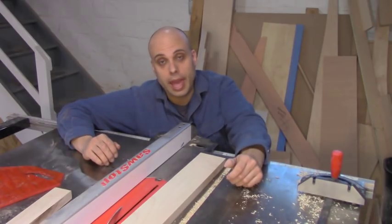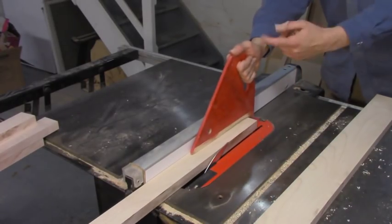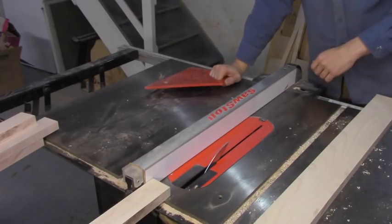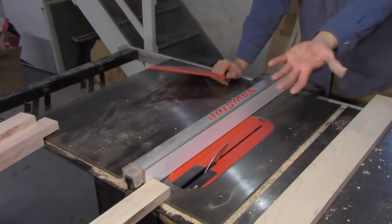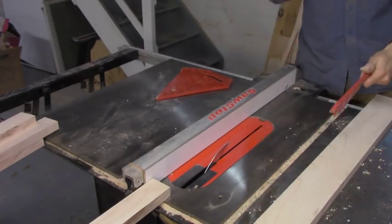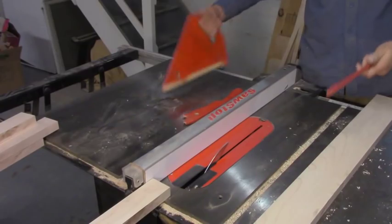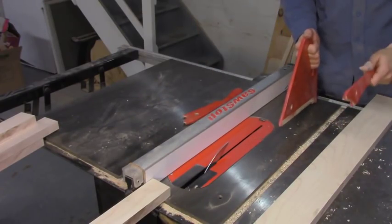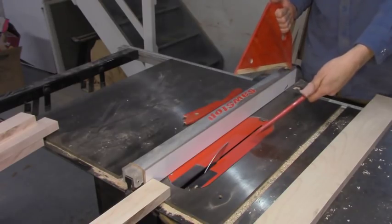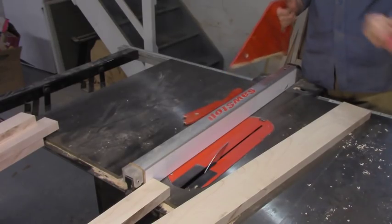Here's what should have happened and what I would have done differently. Ripping the stock with the push stick was fine — this stick keeps me above the blade, I've got a good grip on it, and it's got a heel for gripping the bottom of the stock. But then I was handling the off cuts bare-handed, and that's really stupid. It's particularly stupid when you consider that I have push sticks — I have two of them, hanging from the rafter right above my saw, easy to grab even in the middle of a cut. The way I should have been working is with a push stick in one hand to handle the off cuts, and my other pusher in my right hand for the main cutting. This would have kept my hand far enough away that I'd have been using the stick and not my hand, and then I wouldn't have gotten cut.